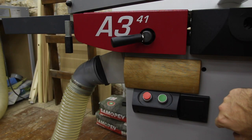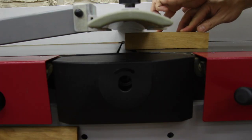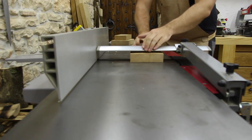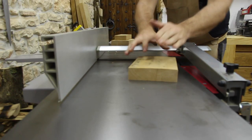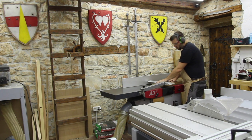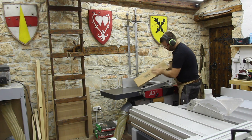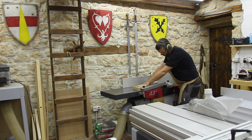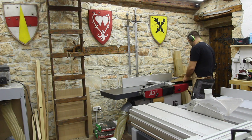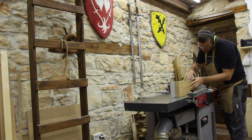I have a flexible hose from the dust collection and we installed remote controls so we can turn it on by every main machine. Now I'm passing these really small pieces through the planer — it's quite a safe operation when you know what you're doing. One face is brought flat and then we reference that face to the fence and take one edge 90 degrees to that face.